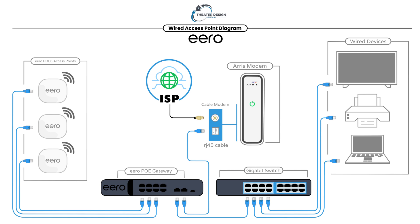The second note: if you're doing this Eero system and you just plug the Eero POE gateway into your Comcast modem without putting it into what's called bridge mode, you get what's called double NAT. Double NAT can cause all sorts of issues with video gaming, Zoom calls, and more. So if you're having those issues, that's why. Buy your own modem — huge advantage.